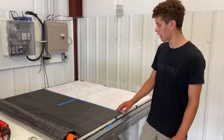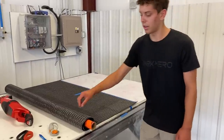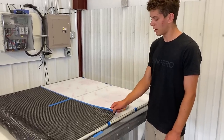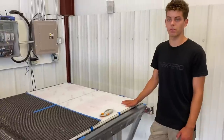Basically how that process works is I roll it out onto this scrap of polycarbonate so I don't damage the router table, then I take the rotary cutter and go through the center of my tape lines so that it keeps a nice clean edge. Once I get all of these cut out, we'll be infusing them and then machining them out for component footprints.